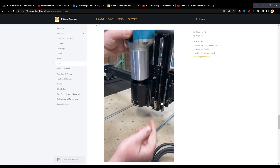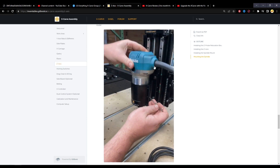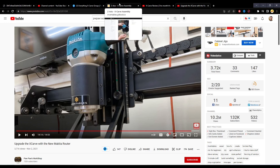They follow the photos, mount it flush, and leave it that way. This same issue gets posted about once every day — if not more — on various Facebook groups as well as the Inventables forum. Part of their carve is the right depth but the other part is not. Sometimes this is because the workpiece has a bow or cup to it, but when it's happening consistently and not fading the way you'd expect with a bow or cup, that's a good sign the Z-axis is simply mounted too high. I have other videos on surfacing workpieces and shimming to address those issues.